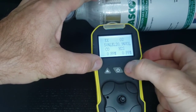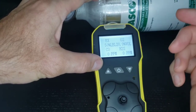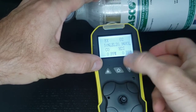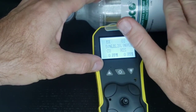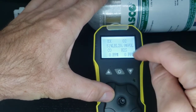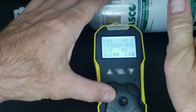Press the right button here if you want to silence the alarm so it doesn't drive you crazy. And you would do that continually — next, next, next. But in this example it was only a single gas mixture. And that's how you calibrate our multi-gas detector. In this case it was the combustible. Have a great day and be well.